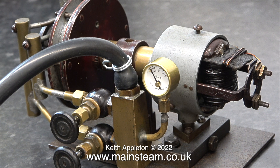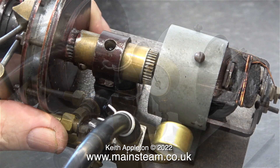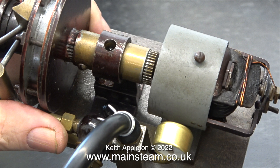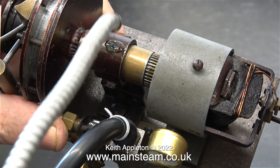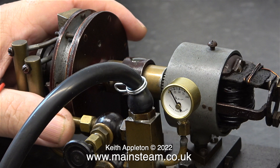Normally I don't use these three-quarter pressure gauges as they're a bit small — to see what the gauge is registering I need to wear my reading glasses. This hole in the middle at the top is really good. It's an oil reservoir and this means that the main turbine shaft, which rotates very quickly, always has an oil supply, and the oil seal is quite good. I haven't filled this up for a while and there's plenty of oil left inside it.